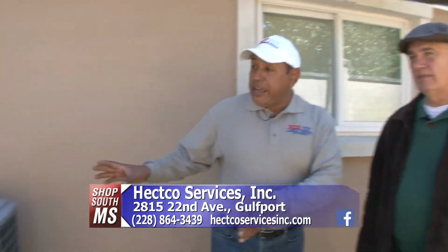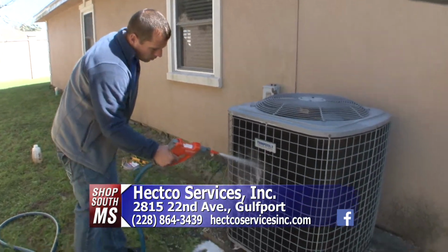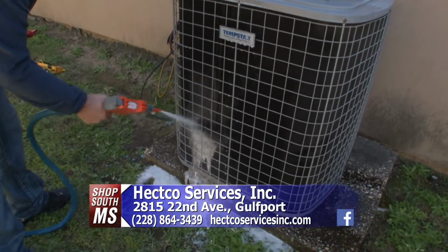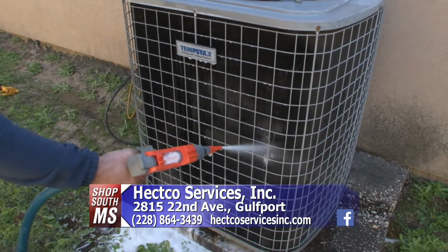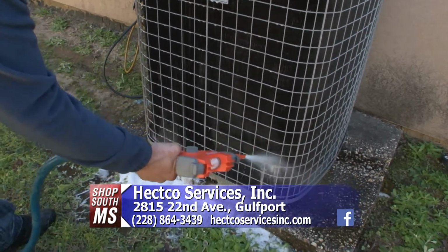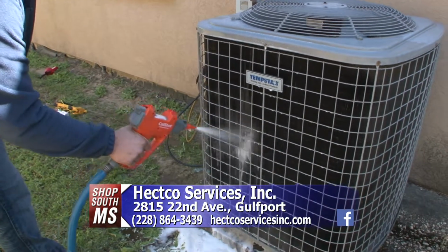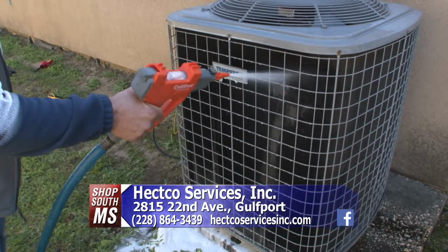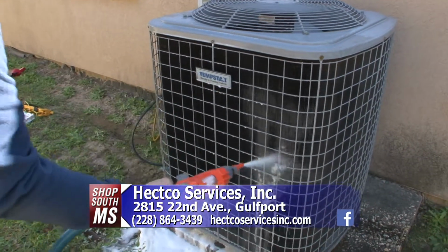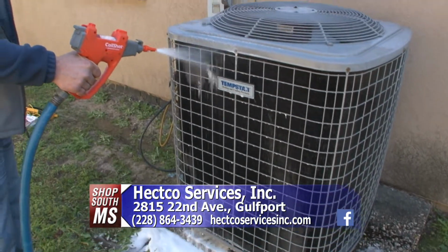Then you start on the outside. That's right. Then we're going to go ahead and get the outside cleaned up. This is a special tool that we have, and it already has the chemicals inside the gun. So as we're shooting the water, as you can see, there's going to be some chemicals coming out, and as it's spraying out, it's going to be cleaning. Then we come back with the water hose just to rinse out anything left over in the residue, so we don't leave any kind of chemicals inside the coils.